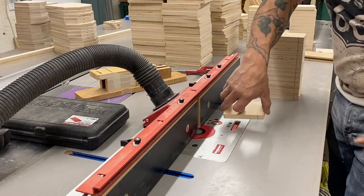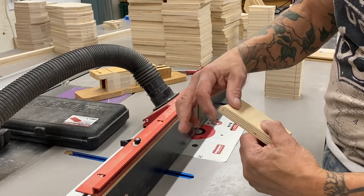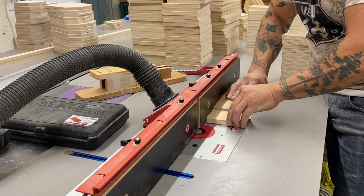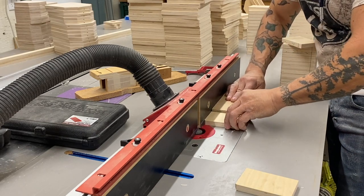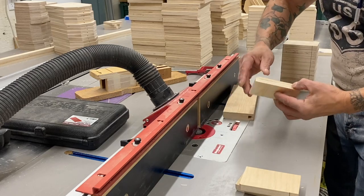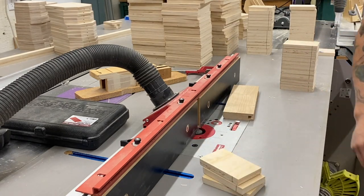I am constantly cutting hundreds of parts for my docks that I make and sell. These in particular get a 3/8 round-over and it'll blow out. At first glance it looks like I could just route a long board and then slice it up, but that would create more cuts because one side of this particular piece has a 2¼ degree angle. So it's actually easier to route hundreds of these pieces individually. Nice and clean.